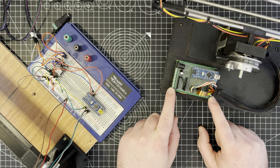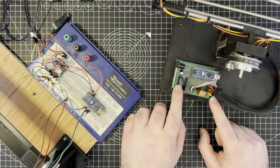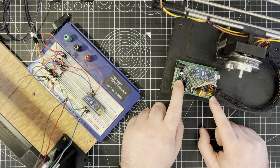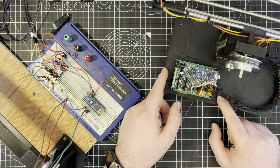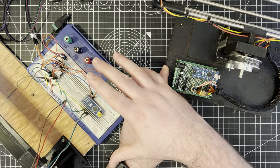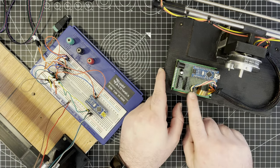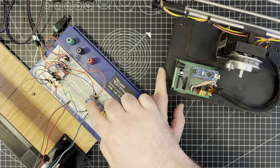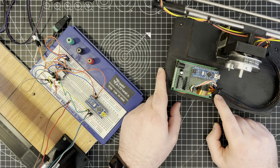This is actually pretty much what I'm going to need for this. It's basically the exact same type of circuit — power decoupling capacitor, a port for the DRV8825 stepper driver, a port for the Nano, and then ports for sensors. Our electronics look pretty similar except we've only got one sensor port, this has three, and we've got the socket for the Nano and a socket for the DRV8825 stepper driver.